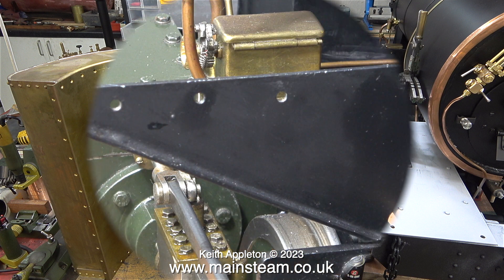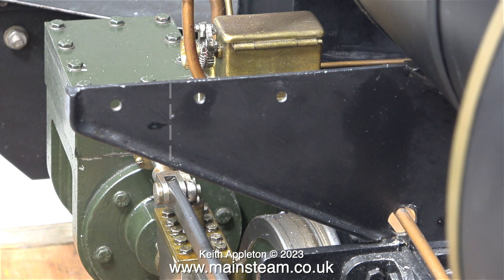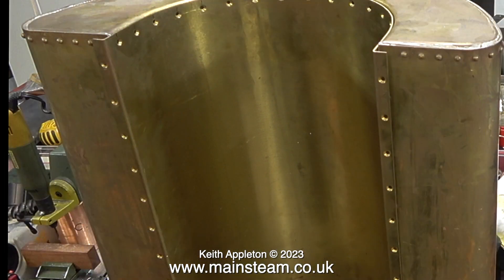The tank curves on the lower outer edges. This mounting bracket is 18 inches long and the width of the tank is 18 inches, but that does not include the curvature at the bottom sides. I'm going to cut this bracket on the dotted line shown here, then make a special bracket that attaches to the tank — approximately the same width as the distance between the two dotted lines. This bracket will also have to mount to the tank in approximately this position. It will all make sense once the part is completed.